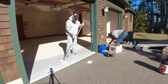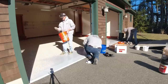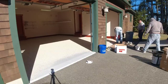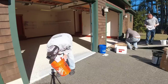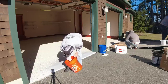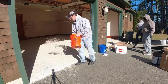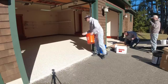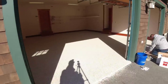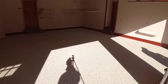It's not going to look like the previous floor that was just a solid color and showed basically every single scratch. After we top coat it, it's going to be pretty much bulletproof. That's another thing about those cheap big box store coatings — there's no top coat. You just roll down the base coat and they give you a tiny little quart can of flakes, you broadcast those in, and that's it. You're not even really protecting the flakes. These floors we do last years — 10, 15, 20 years if they're maintained properly.